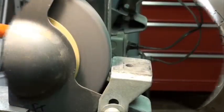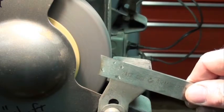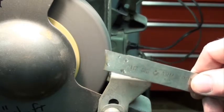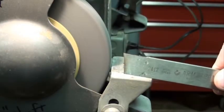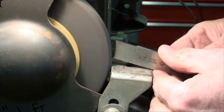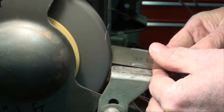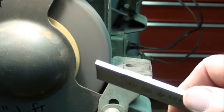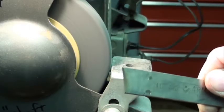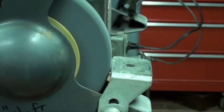I'm at a six-inch bench grinder now and I'm going to sharpen one of these parting tools. If it hasn't been broken off, it doesn't take much to sharpen — just a few seconds. It's alright to let the curvature of the wheel remain because all we're interested in is about five degrees of clearance. Move it back and forth a little bit across the wheel and we're done — I just touched that up. That's all there is to it for grinding these cutoff tools. Make sure that the wide part of the tool is facing up toward the ceiling when you grind.